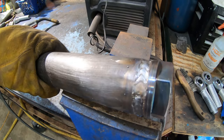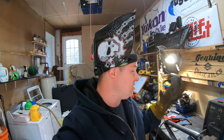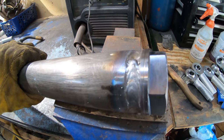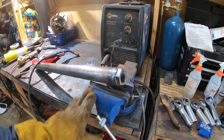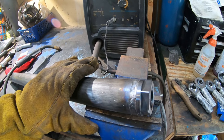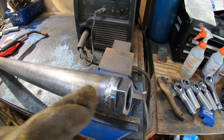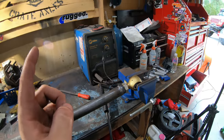We just finished up with the first pass. This should not be your first welding project. You don't have to be a professional welder, but you should find a buddy who's pretty good at welding — use MIG or TIG, don't use stick or flux core. The welds look pretty strong and definitely penetrated well. You don't want to overheat it — you don't want to deform the threads inside. Let it cool a little bit, then put another pass all the way around, then do the same on the other side — making sure we have a reverse-thread bung on one side and a right-hand normal-thread bung on the other.